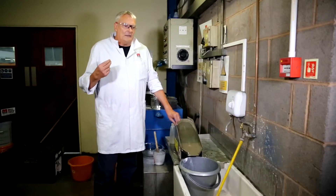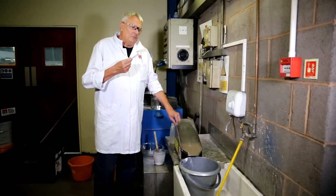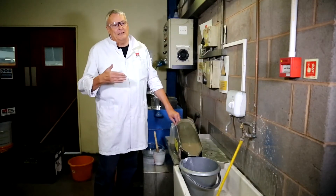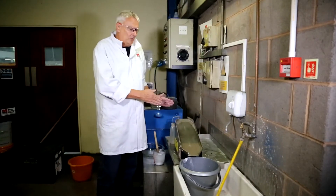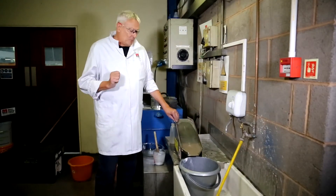People tend to use wet processing methods when they have a very fine particle size range of material, or whether their process is a wet process in the first place — i.e. they have wet ball mills, vertically stirred media mills, or froth flotation. So it follows on, and once you're processing wet, you don't want to dry until the last moment.